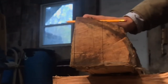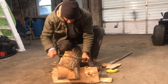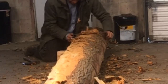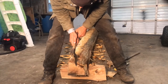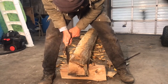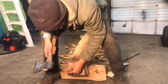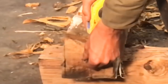I now see how much waste I really need to remove off the sides. To begin, I strip the bark off the top of the log using my hatchet. I cut tiny little grooves in the top of the vertical lines — this is for the string line to rest in — and then tack nails into each vertical line on both ends and run a chalk line from end to end.